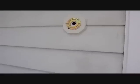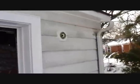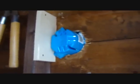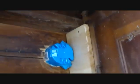Okay, so I got the electrical box mounted and I've got my siding mounting blocks mounted over there and over here. It's a big pain in the ass. As you can see, I just had to add a one by there so I could nail the electrical box to the side. Don't mind my messy hole. It's really a pain in the butt to cut with the Sawzall in a cramped corner. Here's the other one. One turned out a little better. But just had to add a one by both sides.